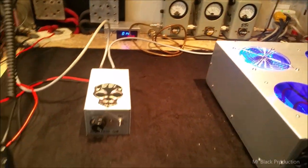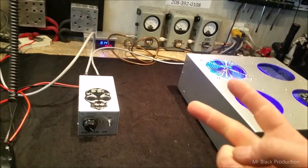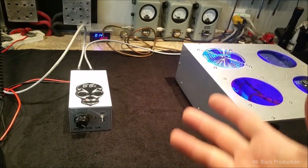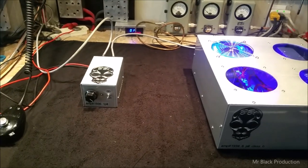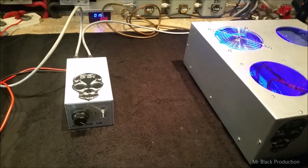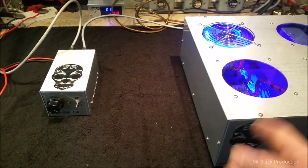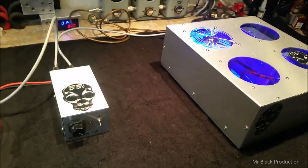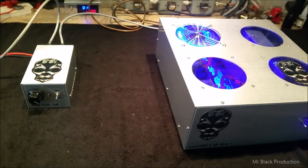All right, so we hooked up our little 3-foot jumper. Let's talk about jumpers for a minute. I apply myself to the 1, 3, 6, 9, 12, 16, 18, 19 foot rule. It's not that critical. If your builder has got salt in his shorts, you can make it so the input tune into each device is relatively low enough that the length of the jumper isn't hypercritical. Going back in the Wayback Machine, everybody was matching each box to each box with the coax length. And we've overcome that.